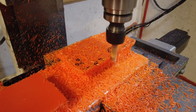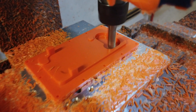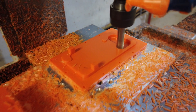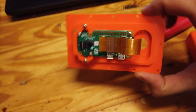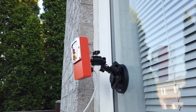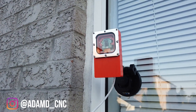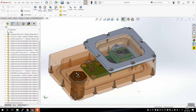A lot of the feeds and speeds I use in wood, I use in plastics. With plastics, I haven't found the limit. I've machined a lot of HDPE and the PM30 just sails through that stuff. It's even a lot quieter than wood and cleaner because it doesn't get saw-dusty or anything. Plastics probably machine the best with the best surface finishes. Wood machines just as fast and it's really easy — if you see any witness marks or tooling marks, rub it with some sandpaper and it always comes out really nice.